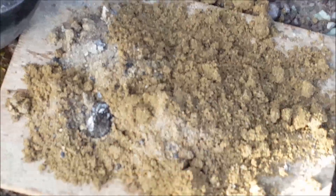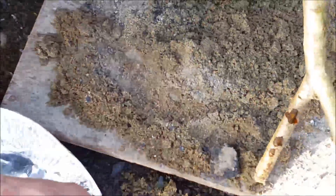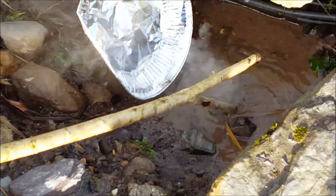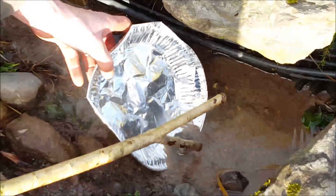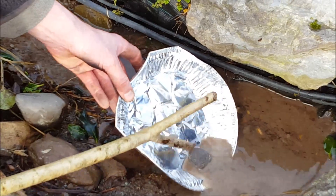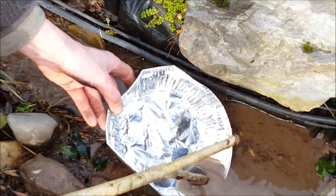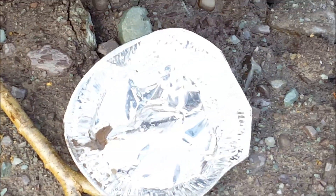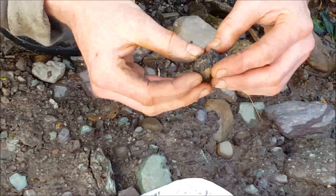Is that just a paper cone? Yeah. I think it's probably either that bit — that's the bit we want. Stick that in there. It's probably about gone. That's our hot pit. That's behaving like a nice lump of iron. That had some heat to it, didn't it, Tom? You don't see that red heat in iron until 500 degrees, so we're still well up there. And that, I think, is a bit of pig iron, basically, at that point.